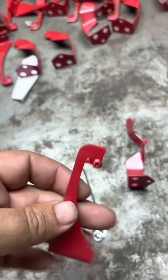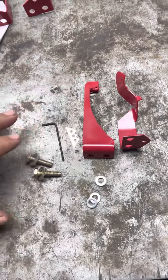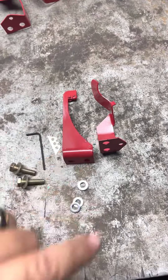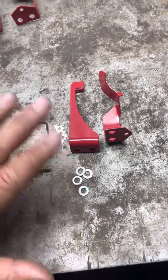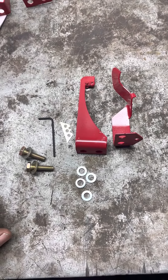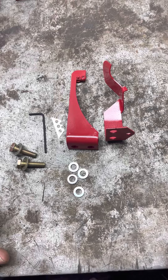So as you can see, there's a reason why I leave them just like that. I send a pack of blades along, so you get five blades with the kit. This is one complete kit right here: two brand new Grade 8 bolts, the allen wrench that changes the blades, the twine tension plate, and a few shims. If you think your baler's got a lot of wear on it, I can send more shims in your kit — just let me know. For any other questions, you can call RNS Ag Service at 607-846-5959.